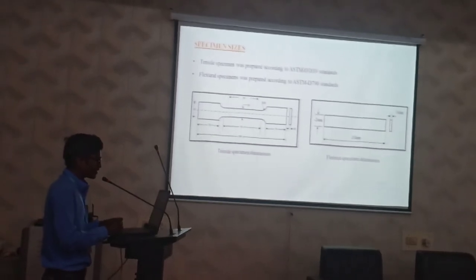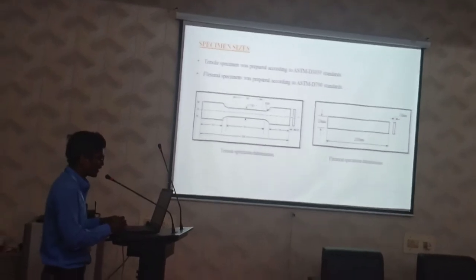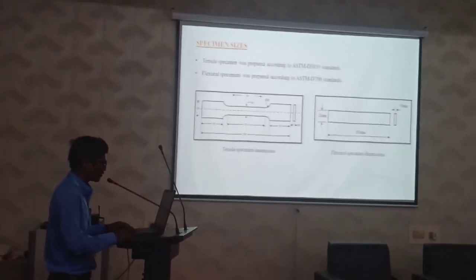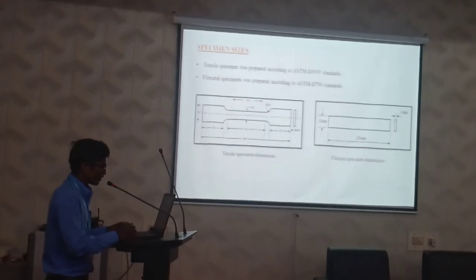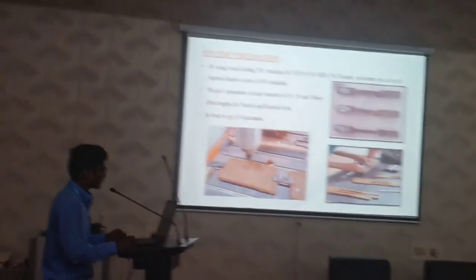According to the ASTM standard D3039, I have used it for the tensile specimen, and the ASTM standard D7264 I have used for preparation of the flexural specimen. And these are the dimensions showing the figures for cutting of the specimens. And coming to the specimen preparation,